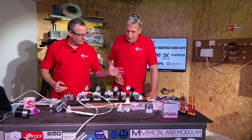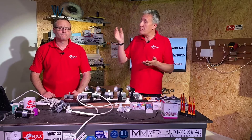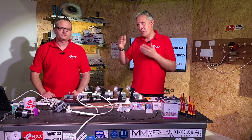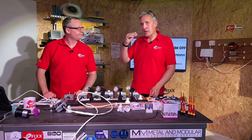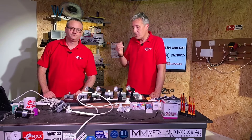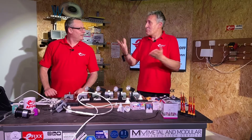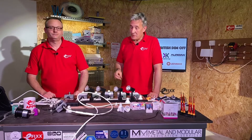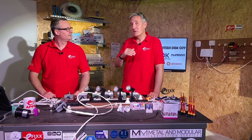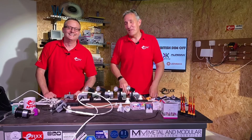That's covered everything we need to know about setting that low end. Know your dimmer, know your lamp. Consider personal preference — do you want your lamps to dim to off or just to a minimum level? Check what happens when you switch the lamp back on: some will instantly start at the lower level, some need a little nudge. Also be aware that voltage drop from other loads — like an induction hob or a hot tub — could affect that low end. If super-critical low-end dimming is required, you probably need to look at a different technology: dedicated fittings, or something like DALI, which is a completely different world not covered in this video.